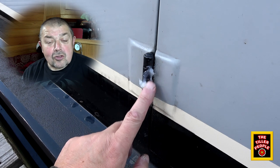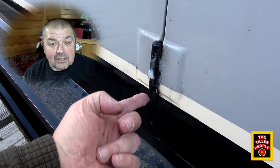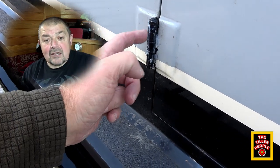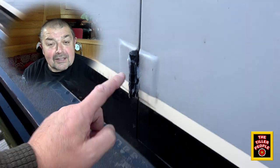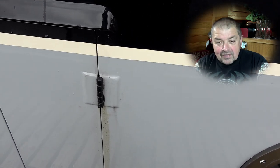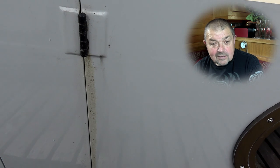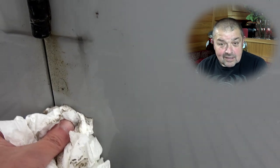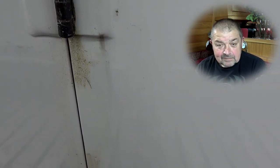And once summer comes, or spring, and it gets hot, you'll see it melt and all the rust bits will be running down the side of your boat, and you think, oh, that looks horrible, but it doesn't take a minute to take it off. You just wipe the Vaseline off and everything comes off, and you've got no rust on any of your hinges. And we've done that for years, and it's certainly a thing that works well. And like I say, in the video we'll show you a few bits and pieces on how I do it. Simple but really effective.